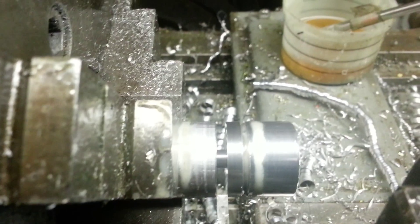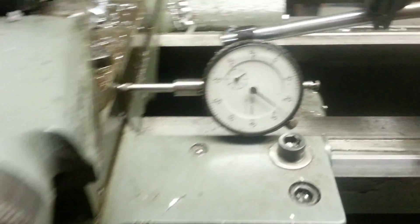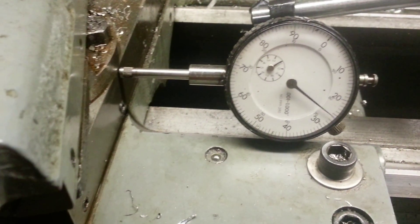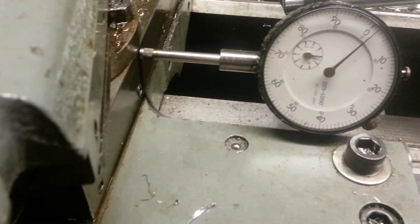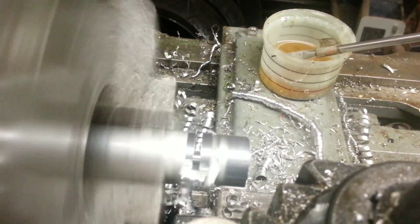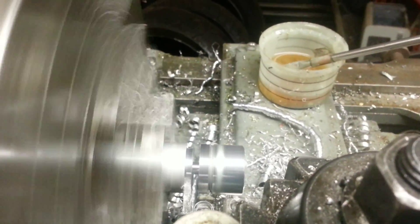You can see the notch that will stick into the drum is now formed. I had the carriage locked so it wouldn't move — I unlock that, and my gauge is still sitting at 8,750. I move it another 125 thousandths, lock the carriage down again, and basically do the same exact operation again. Run it in by hand until it touches, and then finish up. Thanks for watching — hope you enjoyed it.